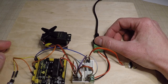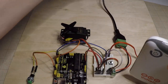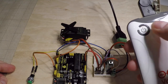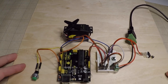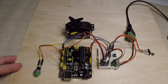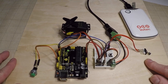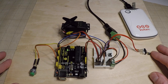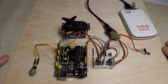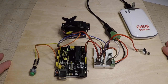Now that we have our USB breakout cable installed, we can power up. I'm going to take my power bank, plug the USB cable in, and push the power button. The crowbox powers up and the servo's going — it's closing the lid right now. This crowbox is currently configured in phase two. If I push the perch switch like a bird landed on top of the crowbox, it should open the reward basket — which it does. There'll be a 15-second delay, which is the time birds have to remove rewards from the basket. Then there'll be 15 discrete steps as the servo closes the lid. That's the behavior we want.